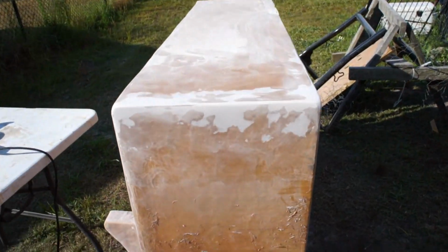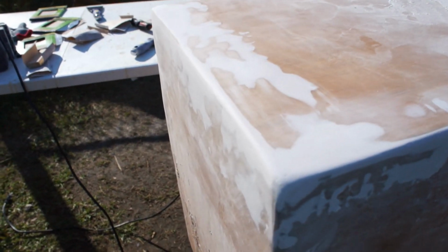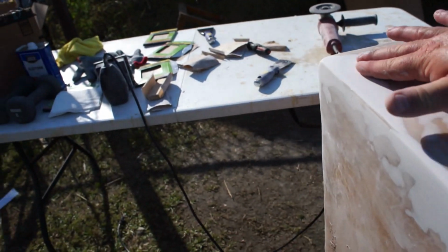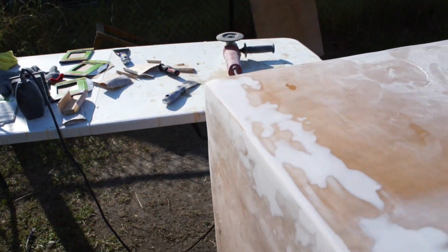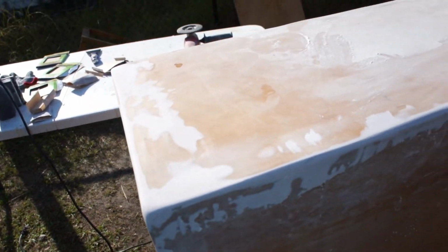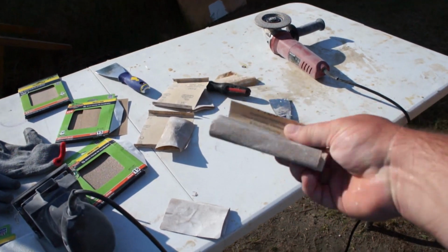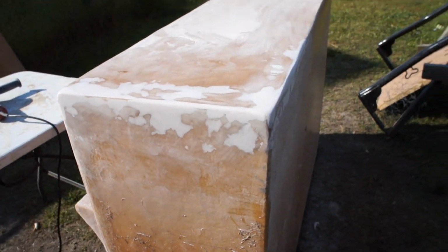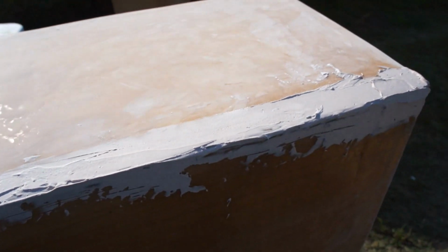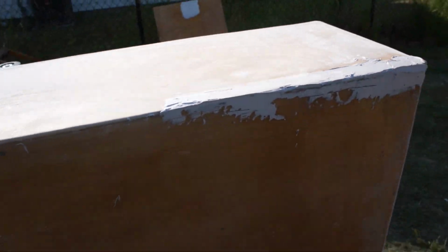I wanted to show you guys what a finished corner looks like after using the Bondo. Now I might have to use some of my pin putty for the little bitty pinholes. I want to be careful not to take off too much material, because you don't want it to go through again, obviously. So basically, I got it down with that regular little square sander, and then the rest of the way I just wrapped a little 1 by 2 with sandpaper, and you work that edge and get it exactly what you want. Anyway, that's what it looks like after the repair. Obviously it would look like this before a really crappy mud job, but anyway, I'm going to keep plugging away, keep sanding.